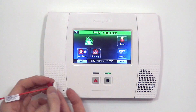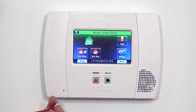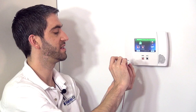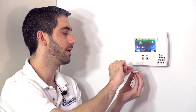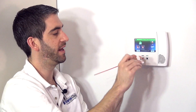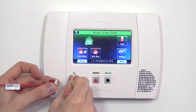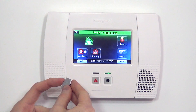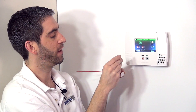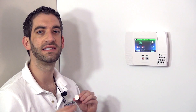This piece would get drilled and inserted into the frame — not into the moving door or window, into the frame. And then this magnet can either just affix to the moving door or window. If it's a window that slides up, you would mount the magnet into the bottom edge of the window, and this contact goes down to the frame. When the window opens, it faults; when it comes down in line, it's back to ready. Same idea on a door frame — you would have this piece on the opposite side to the hinge, and then this magnet would go on the door. You may have to inlay the magnet into the door so it sits flush and doesn't keep the door from closing.